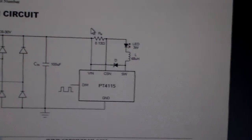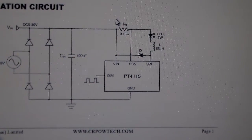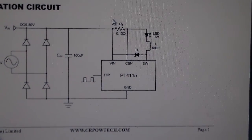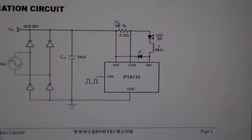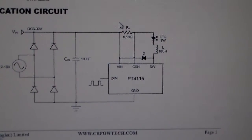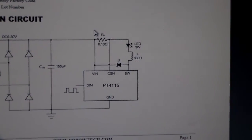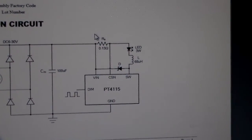So I thought, what if I give it a voltage? I put a potentiometer between the DIM pin and 5V, and I was able to actually get it to regulate the current pretty nicely. I was able to dim the current without any pulse width, so I know that works.